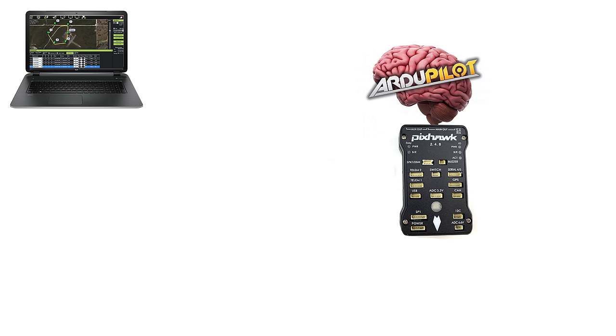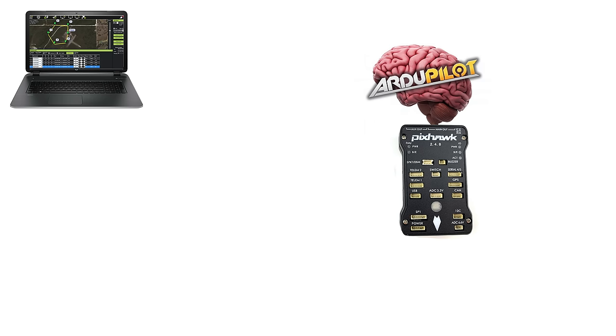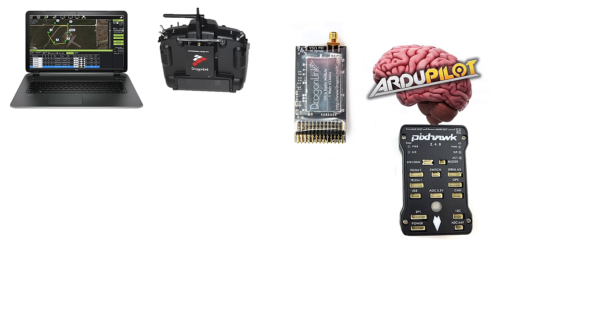So to get the Pixhawk flight controller sending and receiving data from the laptop, we need a telemetry radio. In most cases, you would use a separate radio modem like a standard Pixhawk radio or an RFD900X for long range flying. But in this case, I'm using the telemetry radio function of my DragonLink. Now the DragonLink's primary function is to send my RC controller commands to the receiver on the aircraft, which then passes them onto the flight controller. In this case, I'm also using DragonLink to send the telemetry data. So I have the transmitter connected to the laptop, and the UART pins on the DragonLink receiver are connected to the UART pins on the flight controller. The benefit to this is just that you have fewer radios on the aircraft.